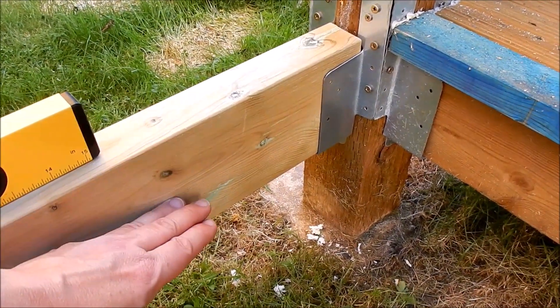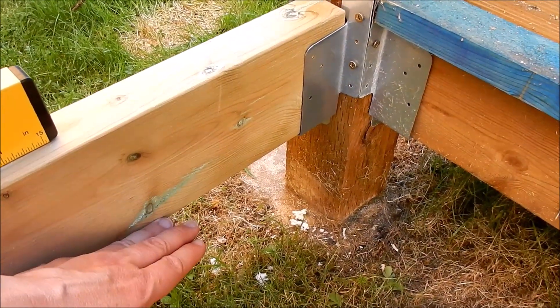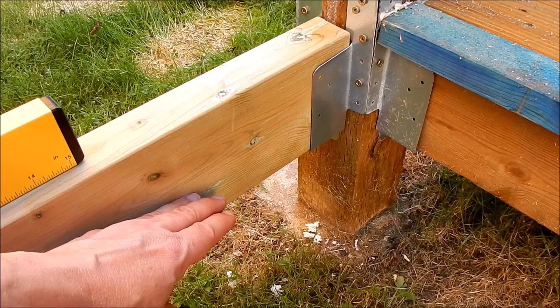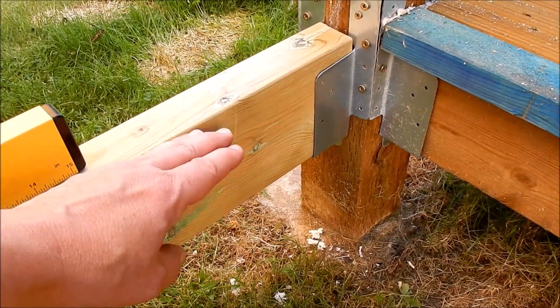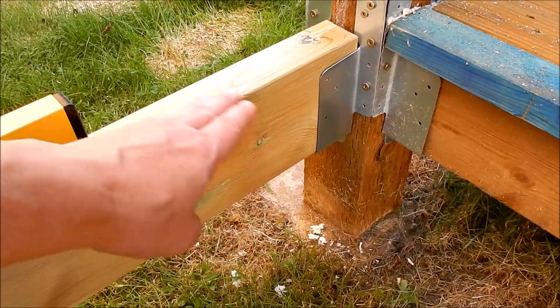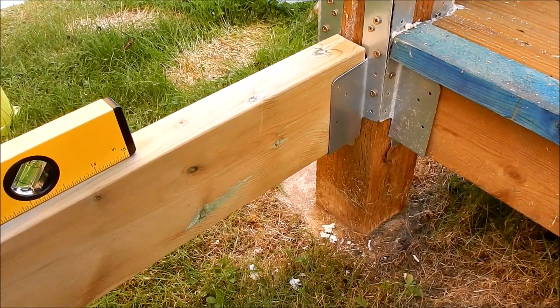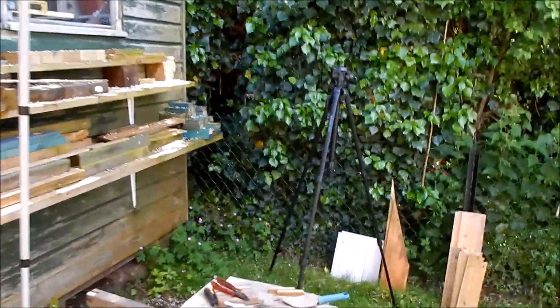The reason they're four-by-twos is because of the mini hanger — I didn't want to go right down to the bottom. You don't need five-by-twos for these cross timbers; there are going to be three of them. Four-by-twos flush at the top, and I put plates across at the top to ensure they're absolutely flush.